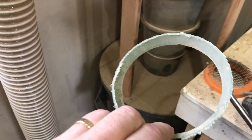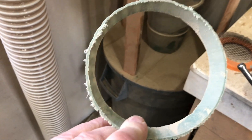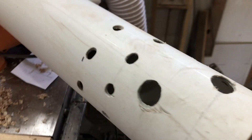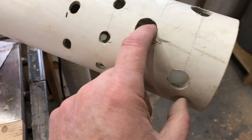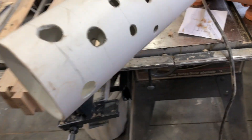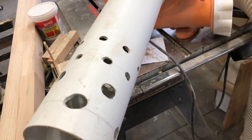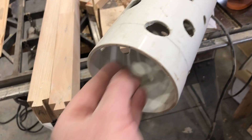I cut that small piece off the bottom of the cone, and you can see that even over that short distance it reduced the inside diameter quite a bit — that should help with cone performance. On the spout, I've drilled sixteen 10-millimeter holes and eight three-quarter-inch holes all the way around. The total area of all these holes is almost equivalent to the entire pipe area, so hopefully that will diffuse the draft from the cone area.